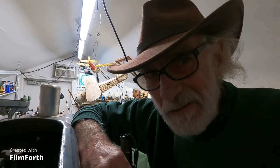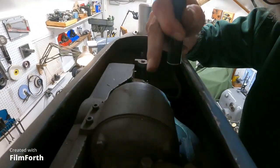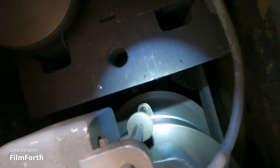I'm up here at the top of the Moore jig boring machine. I thought I'd give you an exclusive look at my machine and a modification that I did make. The number two machine does not have as fine a feed as the number three machine. So what I did is I removed the electronic tachometer generator and replaced it. Down here is the setup for changing the variable speed pulleys.